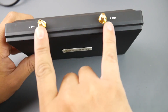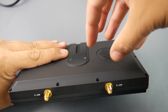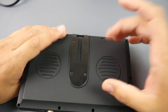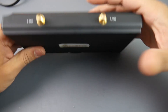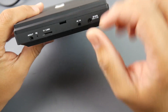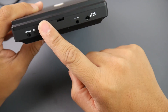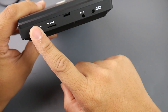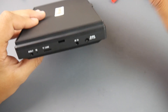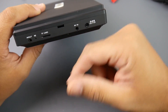We have two antennas, both RPSMA. I've cracked this open — it does have a diversity antenna receiver, so there's a receiver here and a receiver here. We also have a speaker mounting solution and a tripod mounting solution. On this side we have AV in, DC 12V in, and an SD card slot for DVR — because this thing has DVR. We also have an AV output, and they do provide you with the wire you need. You might ask what you need AV out for — well, maybe if you wanted to connect a couple screens together you can route video that way.